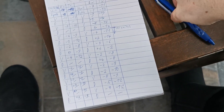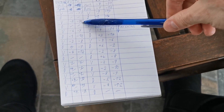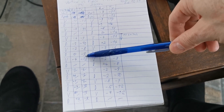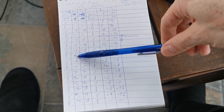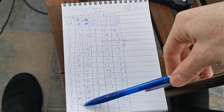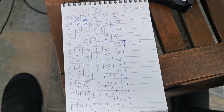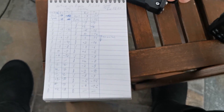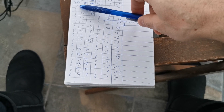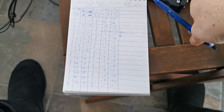I'm finished with the test and I can already see some results. I think the vertical will transmit better and the dipole is receiving much better. I very often see plus values for the dipole on receive, and the vertical is always in the minus. So I would say: vertical better for transmit, dipole better for receiving. We'll see what the Excel sheet says.